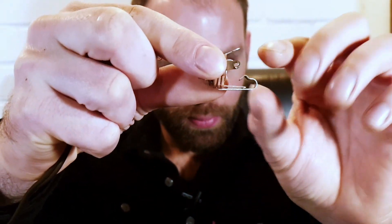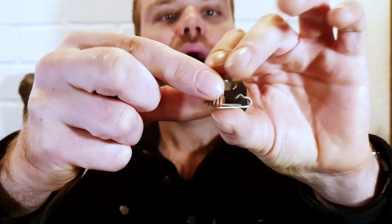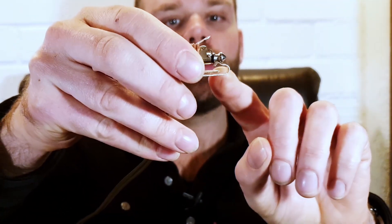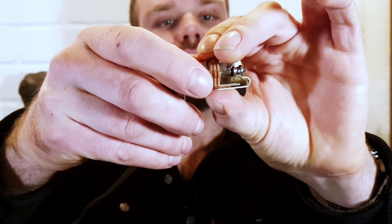If I connect the speaker, it will disconnect the internal speaker. The jack socket has these two metal plates that are connected to one of the lugs. And if you insert the jack plug, they will disconnect. That's where the external speaker will take over from the internal speaker.